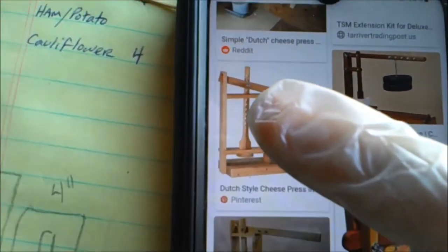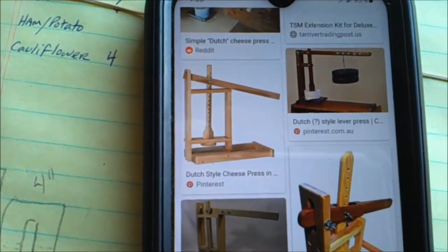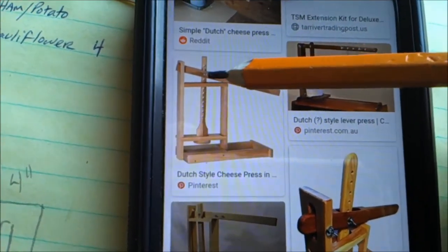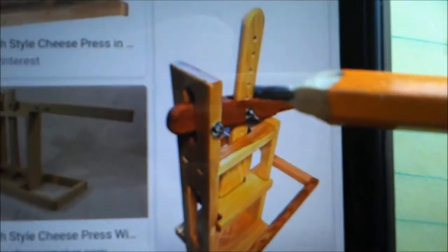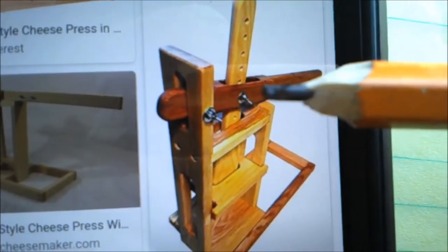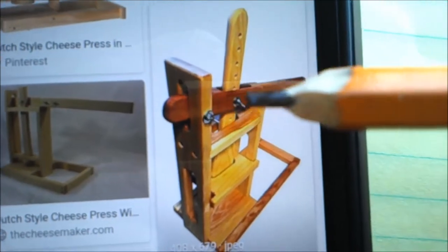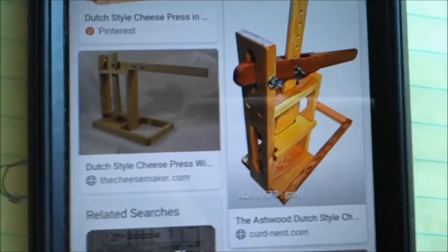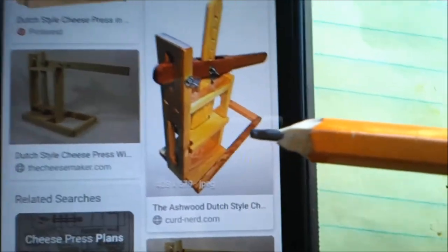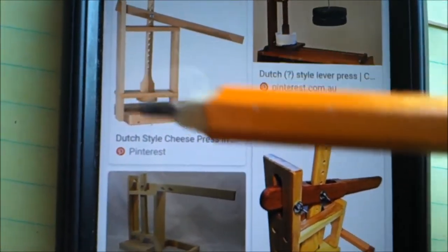In this one right here, you'll see that this upper lever arm is bolted to the press rod that goes down the middle of it. This press rod right here is only bolted on one side. If you look very carefully, this pressing arm has two pieces that go around it that center the pressure on the bar, so there's not likely going to be any twisting. It is also center hinged on the upright on this side — I like that, it's very structurally sound.